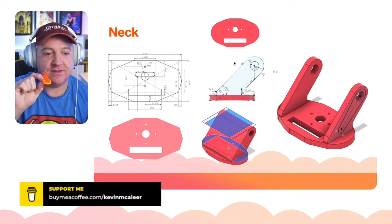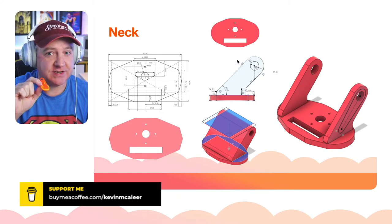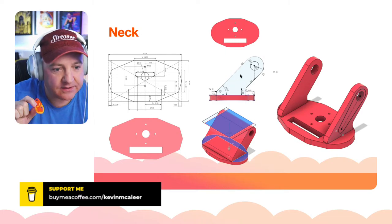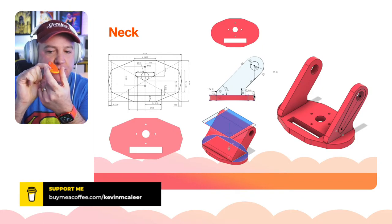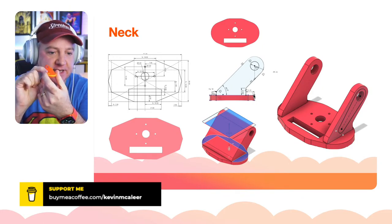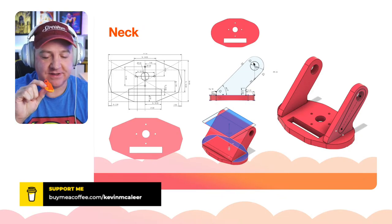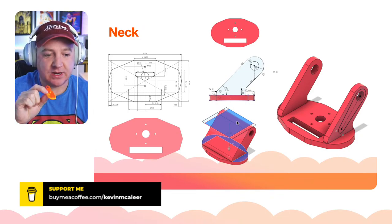And then this was quite an interesting shape because there's not many dimensions on it, and you don't need to because it's the constraints that take care of it. So that angle there of 45 degrees, is it? And the width of this, which is projected geometry from this piece here, that will actually define it, because all these things are fully locked together. You don't actually have to define the height of that. It figures that out itself. And then once we've got that, we end up with a solid piece we can extrude.